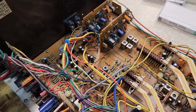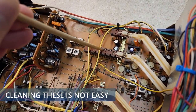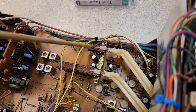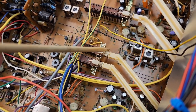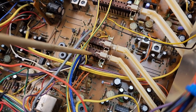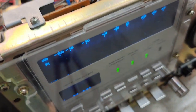Now, the motherboard. Something I always do with a motherboard is I take these switches apart. This is the Dolby switch — you'll get most of your issues here. If it's not clean, you may not get a decent recording. The microphone switch has been cleaned, it works. This is the source-versus-tape switch — if one is depressed, the other automatically releases. Both of these get cleaned, because if they're not, you'll occasionally get a distorted or scratchy sound.